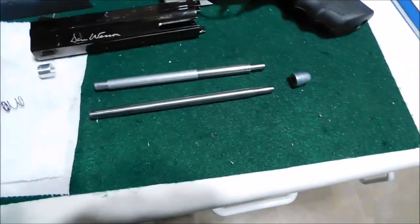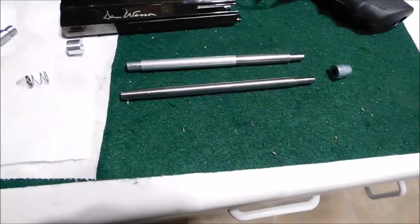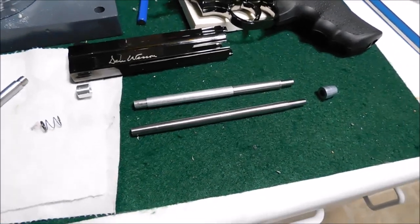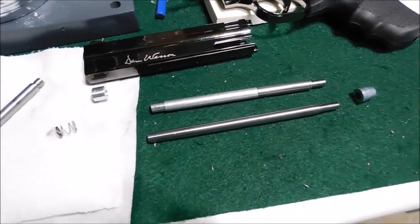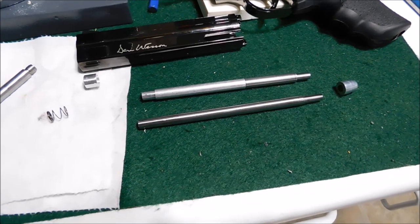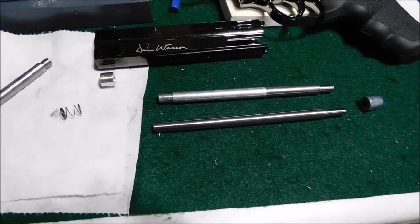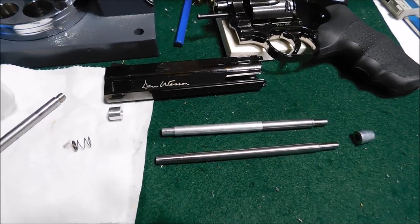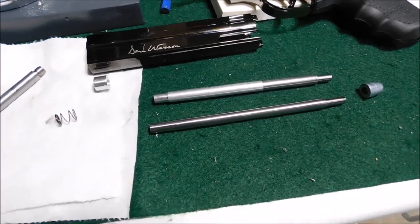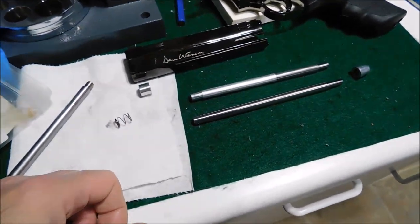And how I did it was, I used my drill press and files and sandpaper, and just very carefully, it took me literally many hours over about 4 or 5 days, mostly because with my shoulder in rehab, I'm so sore I can't do that kind of work for very long. I have to be careful that I don't screw up my shoulder. So it just took a while. You have to be really patient, because if you take off too much or go the wrong way, you mess it up. The drill press is being used, Bubba Hacker style, as a vertical lathe, so to speak. Then you do finishing with sandpaper and so on.